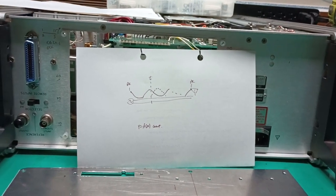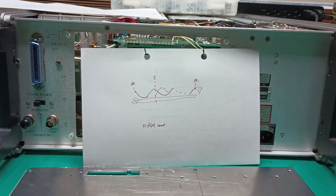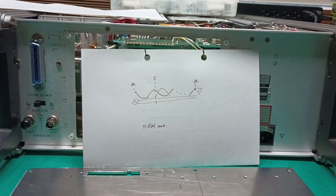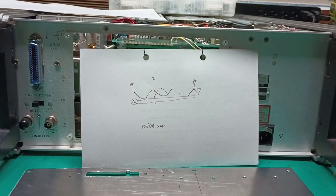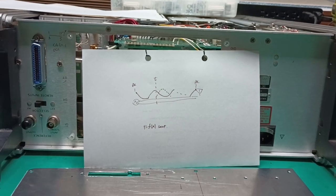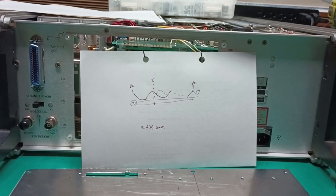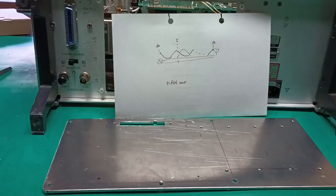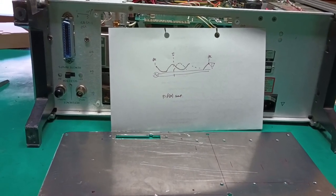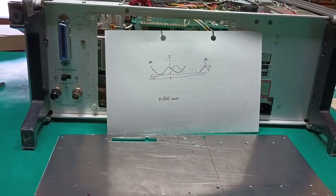Everybody, including the CBers, knows about going someplace in the transmission line, maybe by the transmitter, and putting in a so-called SWR meter and reading SWR to see if the antenna is matched. That's just full of errors. And one mistake the CBers make is pretending that adding some transmission line to effectively move where the SWR meter is, and having the SWR meter read a low value, means they matched something. And that is absolute foolishness. All that's done is fool them into thinking they improved anything and added some transmission line losses and some more energy loss due to maybe some more connectors reflecting.